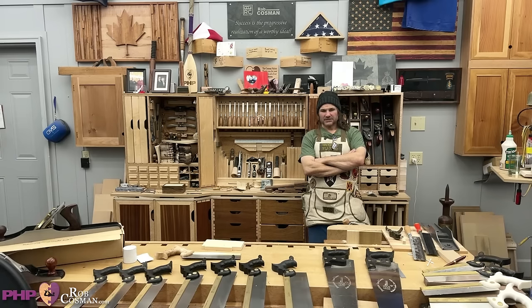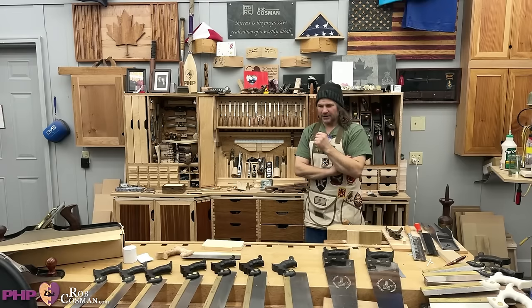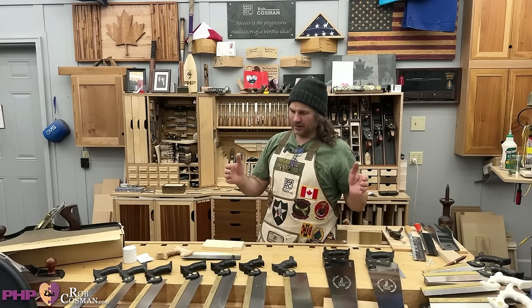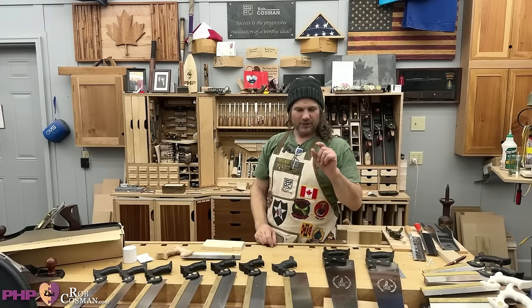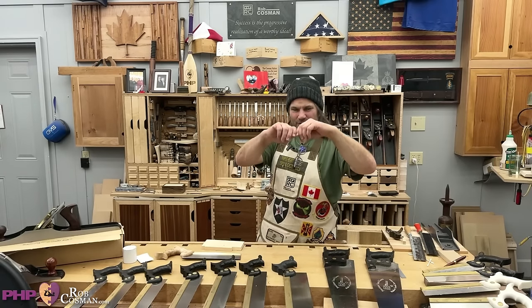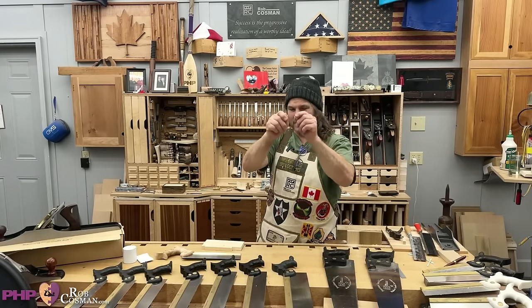If it's really dry and brittle, then you just can't work very small pieces. You have to keep it fairly substantial. It's like when we were making, I love torrefied wood because it's stable, and I love the color, but it really weakens it. So we used to sell our dovetail saws in a wooden box that had little maple toggles that were shaped like a dovetail. They were an eighth of an inch thick, and they were probably that long, and at the widest point they were that wide, and they tapered down to about an eighth of an inch. There's no way you could take one of those in maple and snap it in your fingers. Same thing made out of torrefied maple, you could break it in half like that.